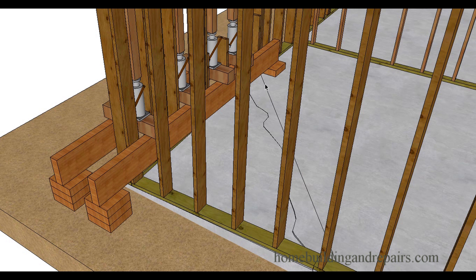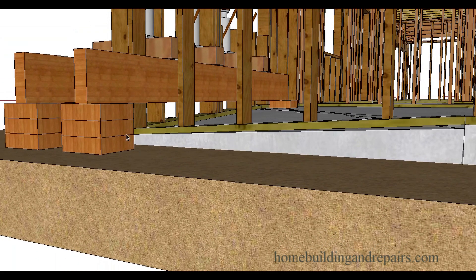If you are going to cut a straight line, make sure that you do it before you assemble the support beams. You can see that we're using a couple of blocks. You want to make sure that the beams are level and at least an inch and a half off the ground so that you can finish the concrete when you re-pour the concrete section. Three and a half inches would be perfect — enough to get trowels and a screed board underneath the support beam. Also make sure that anything you use to support the beams is away from the building enough so you can put form boards next to it. Keep support posts about three inches away from the building.